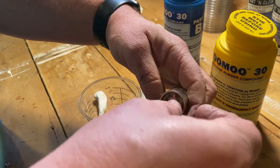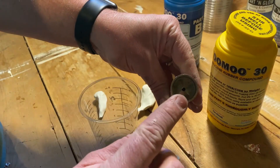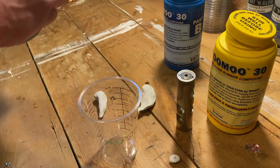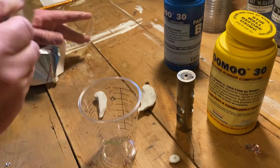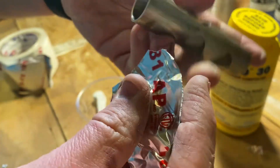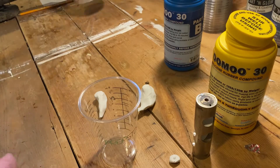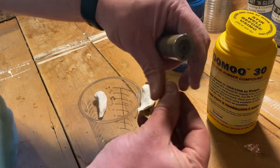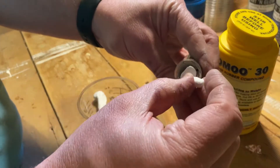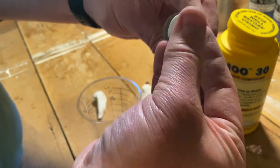Now that I have that in there, I do not want the molding compound to get inside the valve itself. There's a vent hole right here and a stem hole and vent hole right here, so I need to get those covered. I'm going to try some aluminum tape and see if that covers up the holes well enough — but it really won't stick to it very well because it was lubricated once upon a time, so that won't work. So let's try a little bit of clay on top instead.